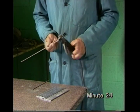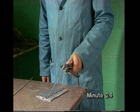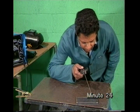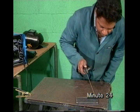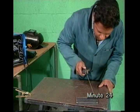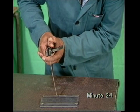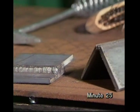If you have problems holding a fresh electrode steady, you can save part-used electrodes for the tricky bits. Don't rest your arm on your knee or on the bench to steady it, as you will find it's very difficult to keep the electrode at the correct angle all along the joint. Instead, if you're using a helmet, you'll have a hand free to steady yourself or to support your welding hand while allowing it freedom of movement.